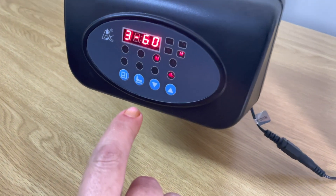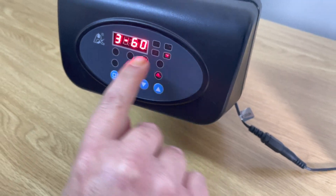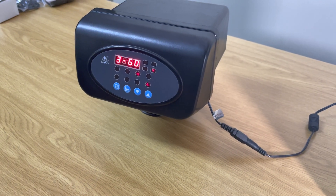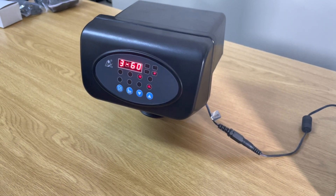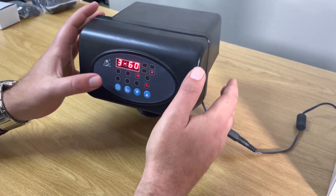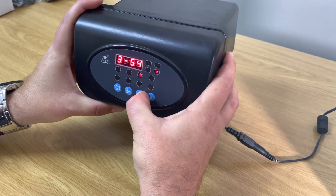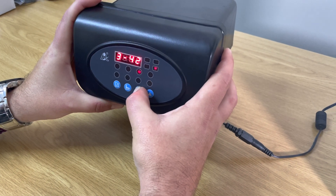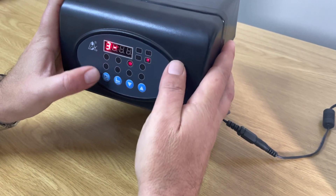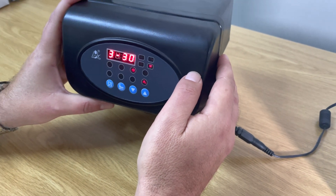This is your brine slow — when the head is pulling water out of the brine tank. It comes at a default setting of 60 minutes. It's always good to keep it at 60 minutes initially. If you're doing more regular backwashes or regeneration, you can set it down to 30 minutes. Press the square button, go all the way down — holding it in moves faster — take it to 30 minutes, then press the square button to lock it. It will now do the brine slow for 30 minutes.